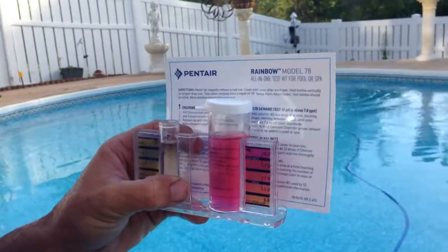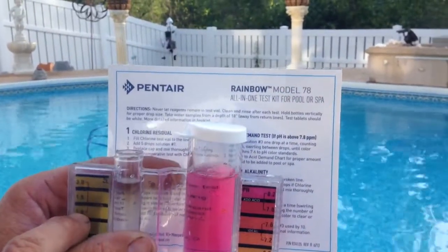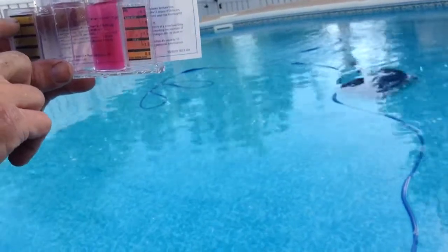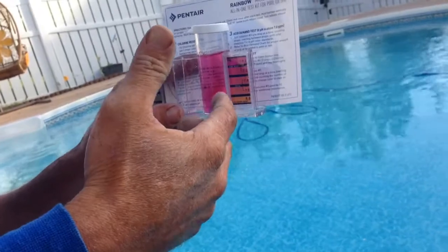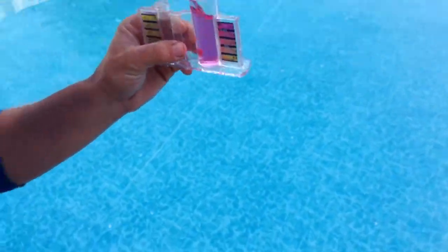Right. And for my solar, just a reminder, for the salt, it should be around 1.5? 1.0 to 1.5 is ideal. If you run it at 3.0, you're overworking that salt cell, which you're taking more hours away from it, which is not going to last as long. Okay. All right. So there's nothing we can do right now.